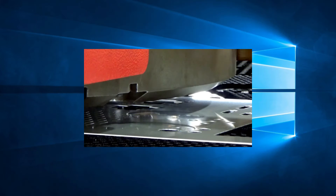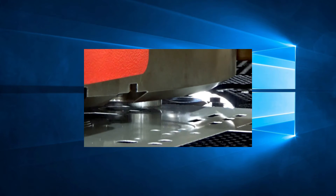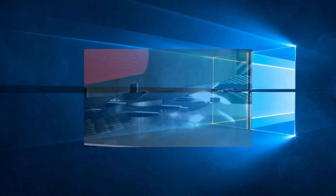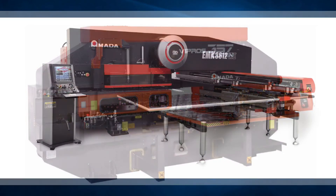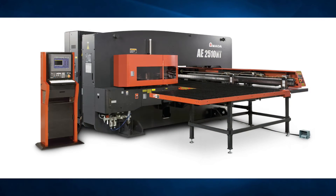What the machine needs to know from our G-code program is what the material thickness is, the type of material, and what punching mode or M-code to punch with. That's where G06 comes in. For modern machines like Vipros, EM, and AEs, we need to specify this in our program before the actual punching is started, before or after the G92.